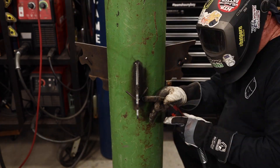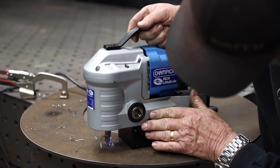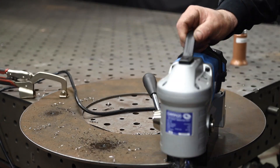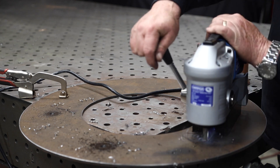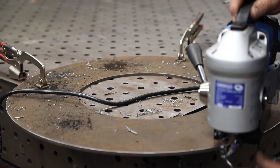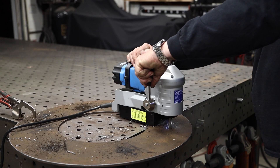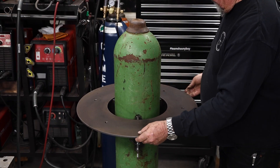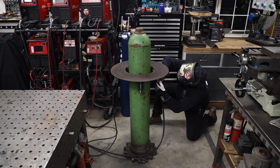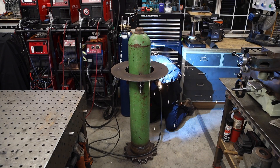Back with the mini mag drill — the little Brute — drilling some half-inch holes around the outside of the round ring. That's going to provide anchoring to the Western Red Cedar. The guy is going to use quarter-inch screws with fender washers, and he mentioned needing a little bit of space so the wood has room to expand and contract and move around freely. Once I got everything centered up, just a couple of tacks, and then on the underside I put a couple of inch-long beads on either side of each bracket — that's all I needed to hold it secure.